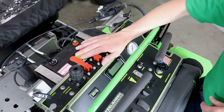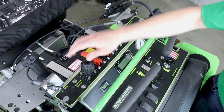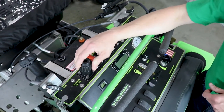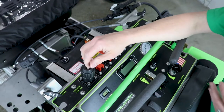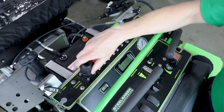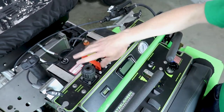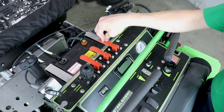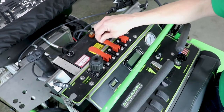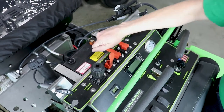Next we're going to move up to the upper bank and talk about the pressure control valve, boom valves, and cables. Starting at the left side, you have your pressure control knob. Turning it counterclockwise backs the pressure down by increasing fluid returning to your tanks. Turning it clockwise shuts that return down and increases pressure to your boom, and your gauge will rise. The three levers are simply left, center, and right — one wing nozzle, one wing nozzle, and the center is two or three nozzles depending on which size machine you have. Down is off and up is on.